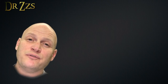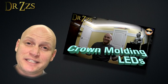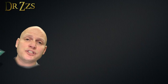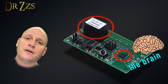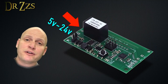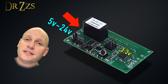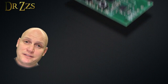I found the SV when I was looking for a cool home assistant controlled switch for my crown molding LED lights, and the SV fit the task perfectly. The SV works just like the Sonoff Basic. It has an ESP8266 Wi-Fi chip, a relay, and a power converter. You can put anything between 5 and 24 volts on the input side. The power converter gives the ESP chip the power it needs, and the rest is switched by the relay and goes out the output side to power your low voltage device.